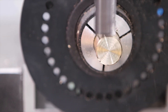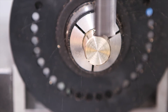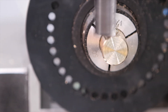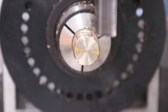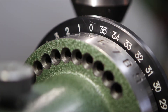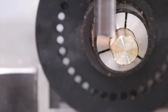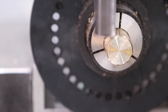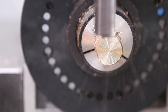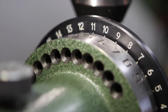As a demo I'm going to show making a very simple bolt head - 6 faces, quite easy to work out on the spin indexer. 6 into 360 is 60 degrees, so we need to index it round by 60 degrees each time - simple enough. I'm milling down about half a millimeter at a time until I'm happy with the size of the flat for the first face. Now I'll index round to 60 degrees. To keep the faces nice and consistent I'm not going to go up and down on this cut - just straight through at full depth. It's only brass so it's pretty soft and shouldn't be too much of a problem for the mill. From here it's simply a case of continuing to index round until the remainder of the cuts are complete.